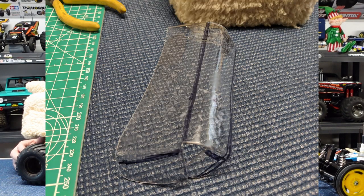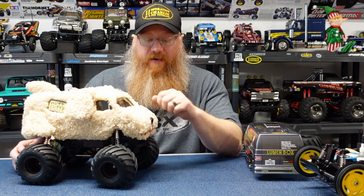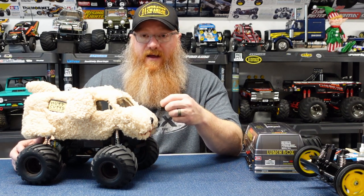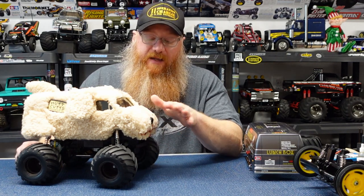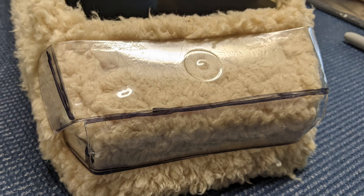Then we started heating it up, and that was painful — I had to go get gloves because I was burning my fingers trying to bend it. The bad thing with Lexan is there's a fine line between solid and liquid, so you have to test it, keep heating it up and testing it. Once you get it to the point where it bends fairly easily, stop. Don't put any more heat on it because after that it gets gooey, stretchy, and messy — really hard to control. So I heated it up, bent it, cut out some reliefs, bent the edges over and cut out more reliefs.